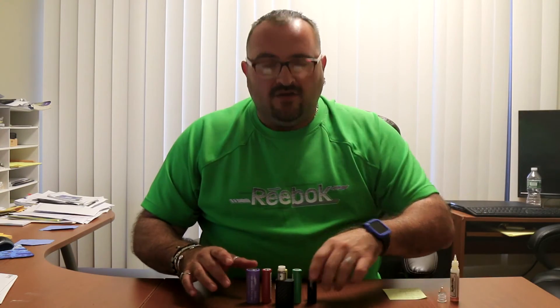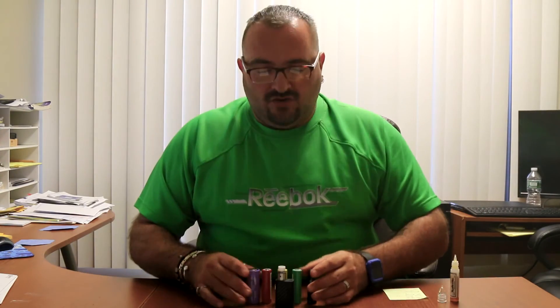Regulated devices like this one get rid of a lot of the issues. Even this small device has built-in limiters that prevent overdrawing the batteries — that's why it's called regulated. With non-regulated devices, you want to make sure you're using safe batteries — IMR or INR chemistry — with true amperage ratings and good milliamp hours, to get quality performance without any issues.